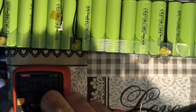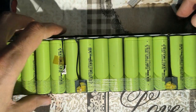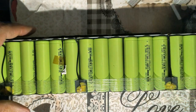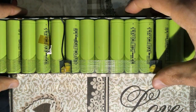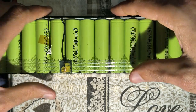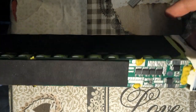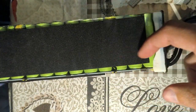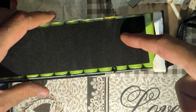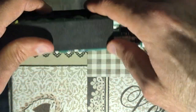So we have already identified the issue with this battery pack. There are two strings of cells that have at least one defective cell among them, and they need to be repaired — those cells need to be removed and replaced with a healthy cell. This explains the behavior the user described: it would indicate that the battery pack is charged very fast. Once we start charging, those cells holding 3.9 volts are going to reach 4.2 volts very quickly.